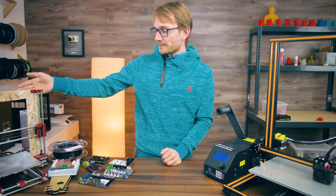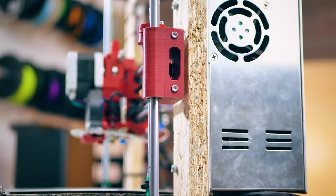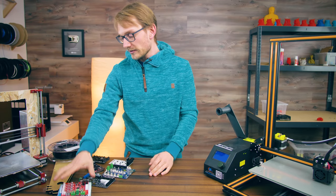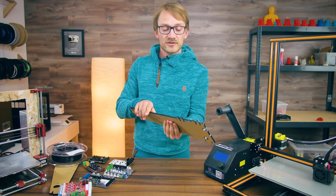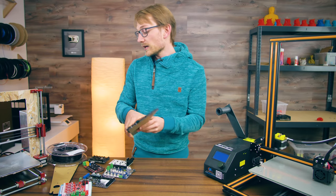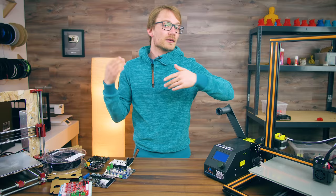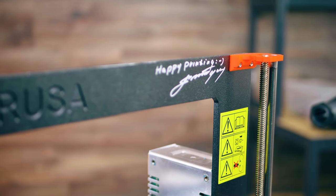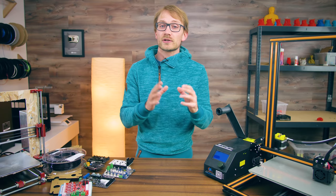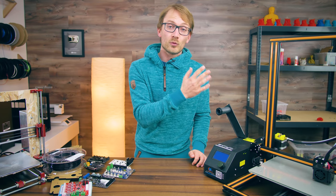This is pretty bad — it's wood. Mechanically it's a great material, but it would make great kindling in a campfire as well. This acrylic frame from the Anet A8 is still going to burn pretty well — this is going to be a decent-sized fire. But an all-metal frame, like on the CR10 or the Prusa machines, is of course not going to burn, at least under normal conditions. I'm just going to assume you're not printing in a 100% pure oxygen atmosphere where aluminum will actually burn.